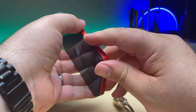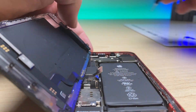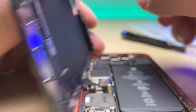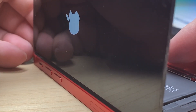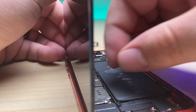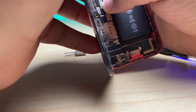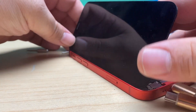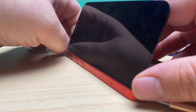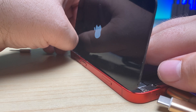Let's start to poke around and see if we can find some corrosion causing the issue. The second and third most common culprits are the charge port and the proximity sensor. I'm going to disconnect both and see if it still boot loops — and it does. So I know it's not those. Now I'm going to disconnect almost every single connector, reconnecting only the charge port to prompt boot. Checking the board with my hand, it's getting pretty warm, so there's probably a board issue here.